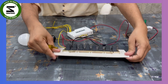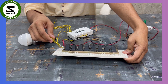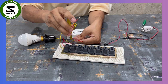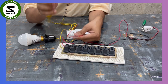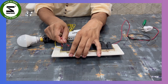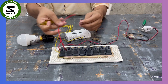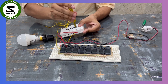I am connecting S1 onto the switch. The switch wiring is now complete — there was a phase connected which is still there, and S1 is connected on the output side of the switch. Since the module requires both phase and neutral, we need to connect the phase. Phase is already coming into our switches, so we will take the phase from there and connect it to the L point of the module.